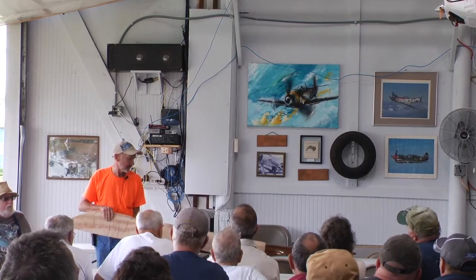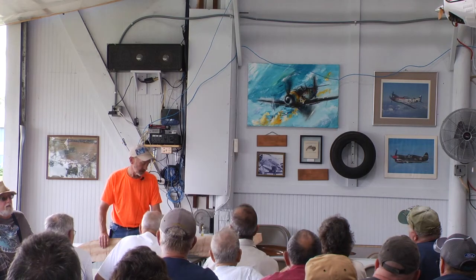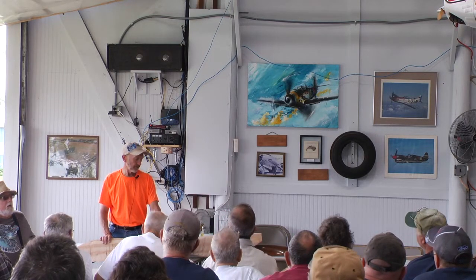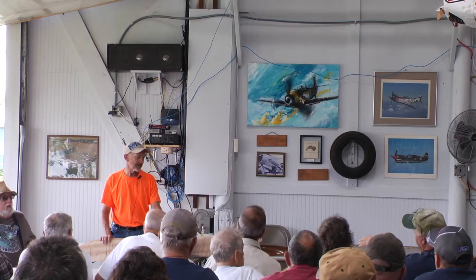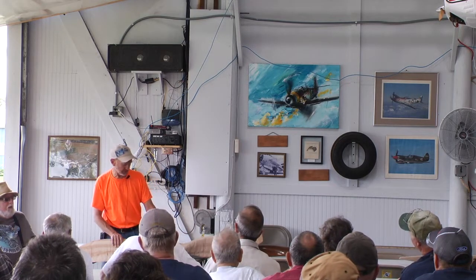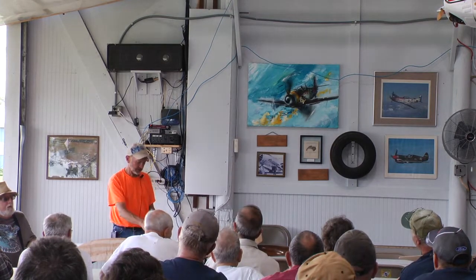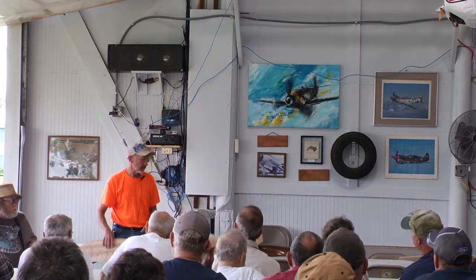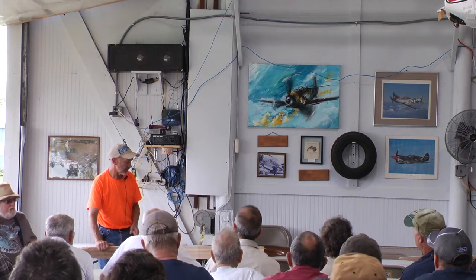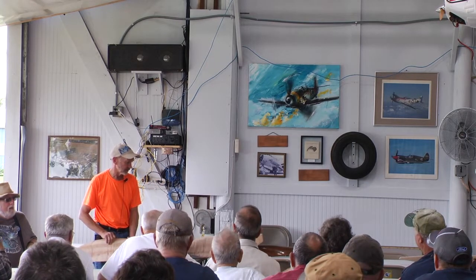He's noting that I have different thicknesses of some of these laminations, and that's correct. I think what happened was I ran these through the planer for one reason or another. I can't remember now. I wanted to end up with a certain thickness. And so that's why I added those two thin laminations. Ultimately, it really doesn't matter what the thickness is. You could have all three. No, you wouldn't want to do that because you want to have symmetry on that.